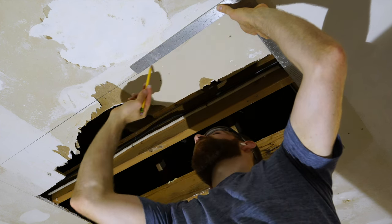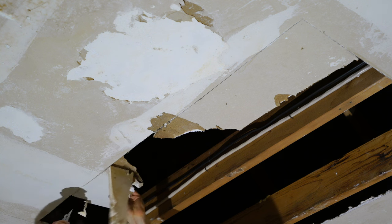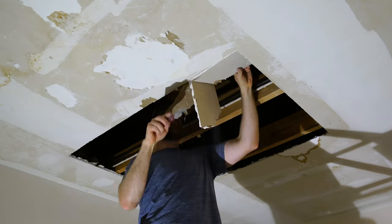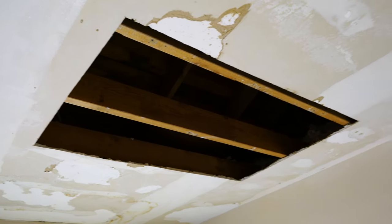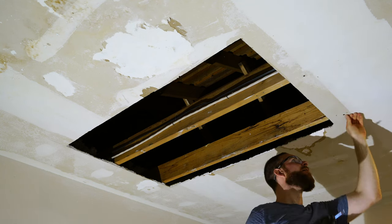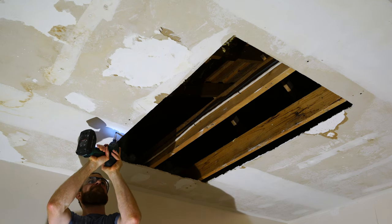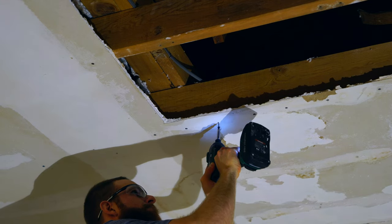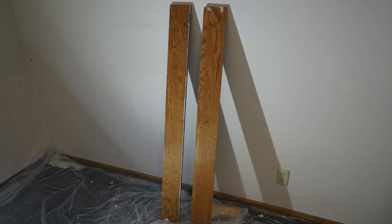You don't have to make the cut along a ceiling joist because we can use furring strips to create a platform for the new drywall to be screwed onto — keep that in mind when making your cut. The main goal is simply to remove all the damaged drywall so your edge is structurally sound. With precise measuring and careful cuts we can get a perfect rectangle. Next, securely fasten the existing drywall's perimeter to the ceiling joist with screws all the way around so that whole edge is securely mounted.